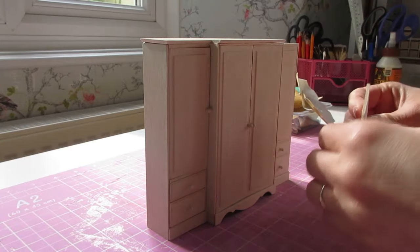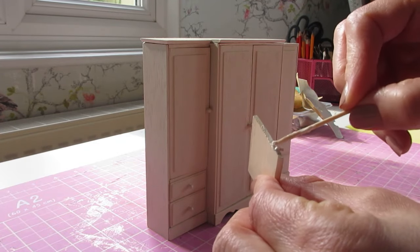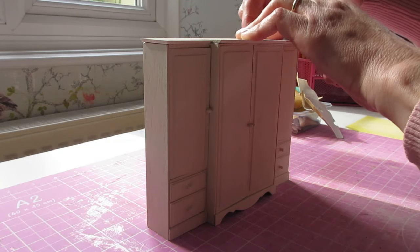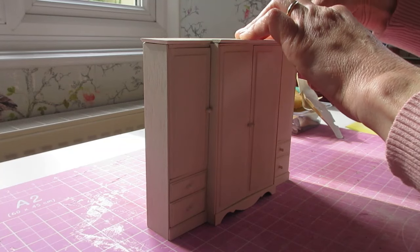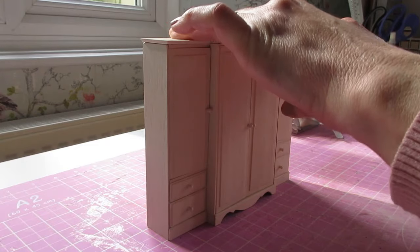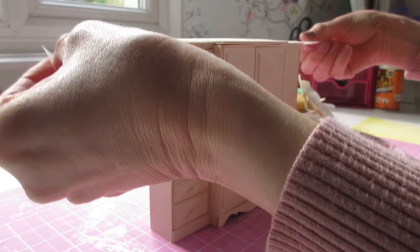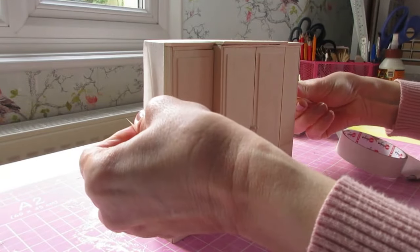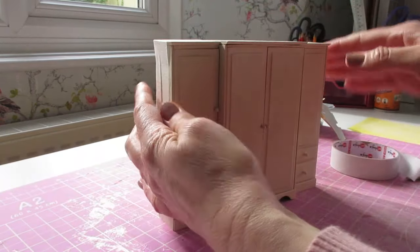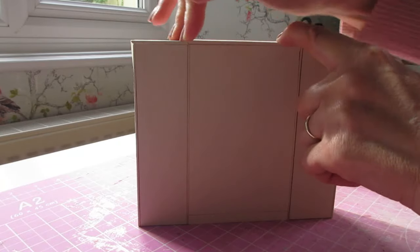Do the same for the remaining side — put a bit of glue along the side of that piece, sit it along there, and again check for that flush line along the back. Now I'm going to put a bit of masking tape straight over the top and put a few clamps along the front edge as well. A nice long piece right across like that — have a look around the back and if you've got any lifting put some pieces going straight over that.